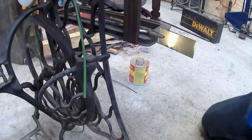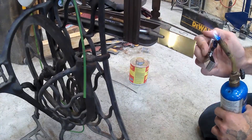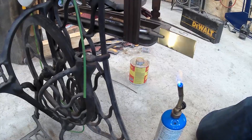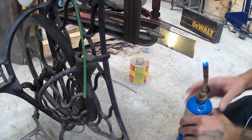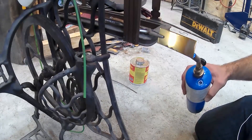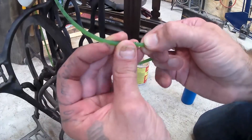As far as our belt goes for this part, we're not going to be using a leather belt like we did on the other section. We're actually going to be using a rubberized belt typically used for a watchmaker's lathe or a jeweler's lathe. We'll do that by heating up a little piece of sheet brass and pressing either end of the rubber belting to it, allowing them to melt and hold together while they set.